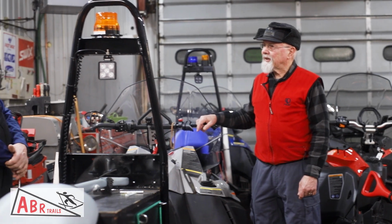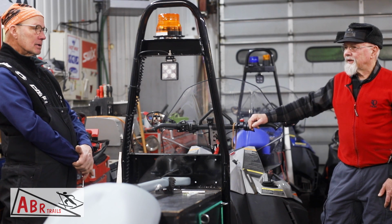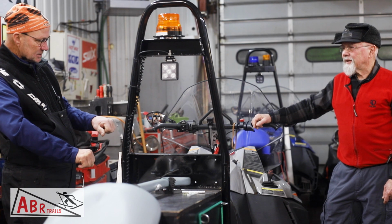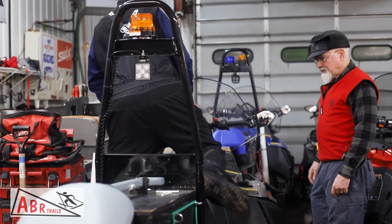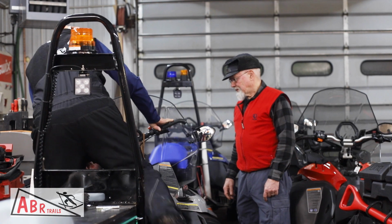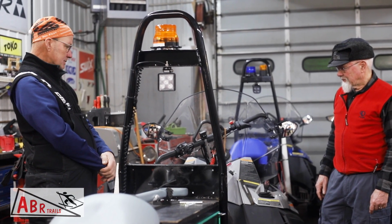But on a day like today, we've got a good hard wide base on the trail. If you fall off the trail, you could get stuck, but if you follow the trail with 3 inches of powder, you shouldn't have any problems. The main thing is to feel when the sled's starting to go off the trail. Let's say it's going off to the outside: turn and hit the brake and wiggle and give it some gas, but hit the brake to give the skis a little more purchase and try to get it to come back up. But if it doesn't, just stop and unhook or winch.